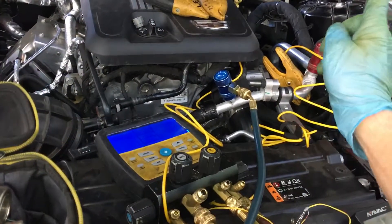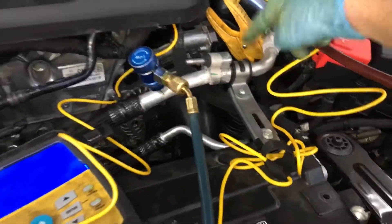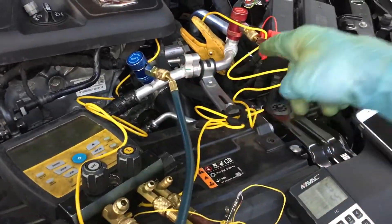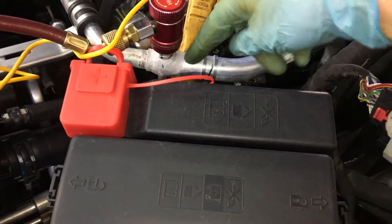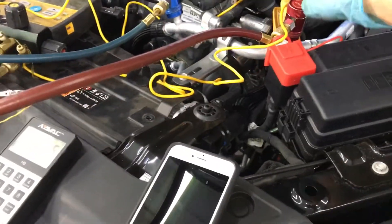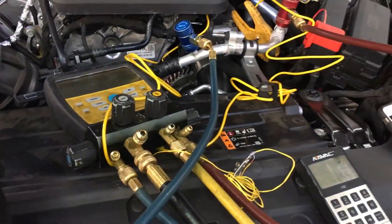What we have here is a singular line with a heat exchanger. If you look carefully, you'll see the diameter here compared to the diameter of my finger back here — that's much bigger; that's a heat exchanger. So you would have a liquid line going to it. There is your liquid line heat exchanger coming from the condenser — hot liquid gas coming into the heat exchanger, and then through a series of tubes and chambers and fins on the outside of the suction line, going all the way down, it comes back out right there and then feeds to the expansion valve. So the low is actually on the suction low side, and the high is actually on the liquid high side.